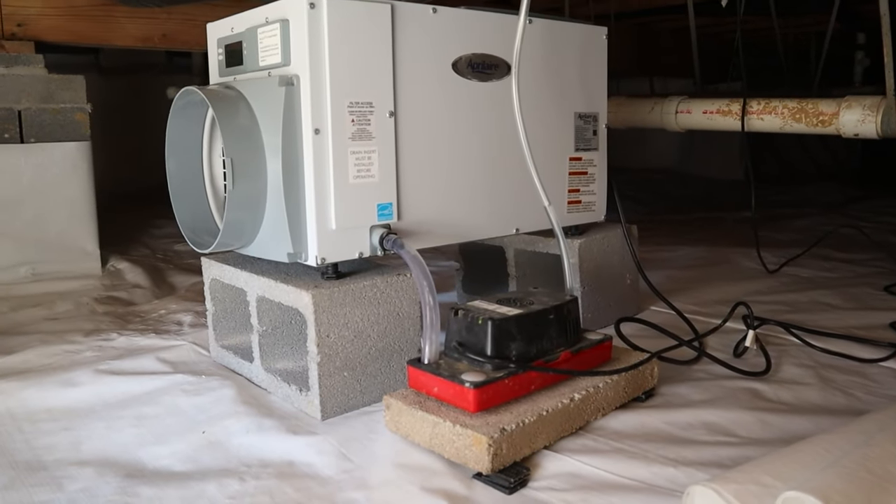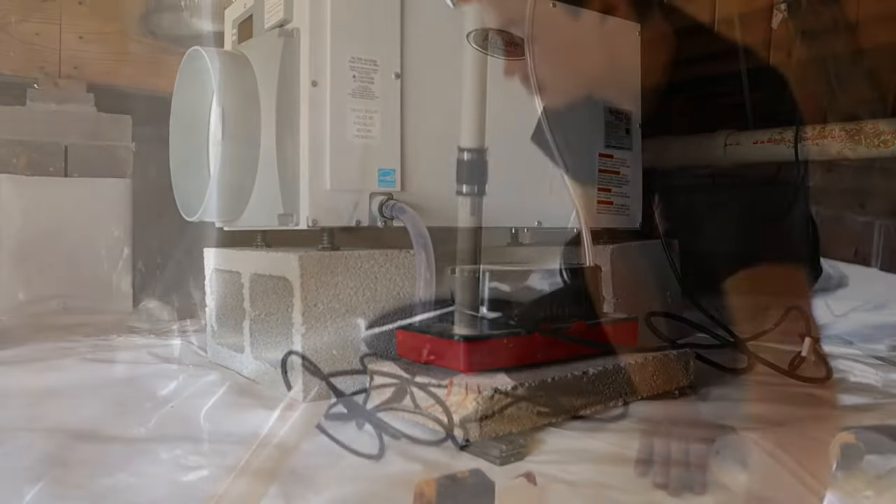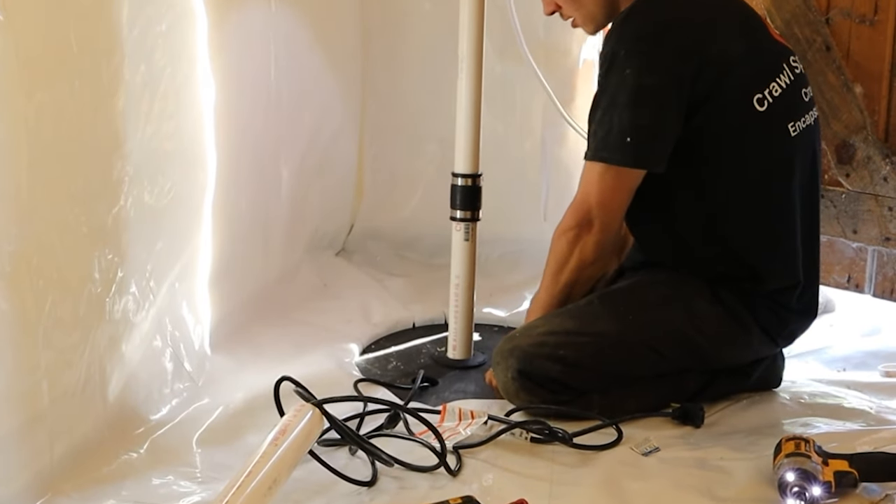You could also place them around your washer and dryer in your utility room with that water sensor behind the washer. Most home floods are from busted washer water lines — those rubber lines — I believe that's the number one reason why homes flood. So having that water sensor in there is important. Number two is probably the ice maker from the refrigerator. We've actually seen that more than anything else. And obviously for Crawl Space Ninja products, you could put the water sensors by the condensate pump — if the condensate pump fails, it will alert the homeowner — or on top of the sump pump pit, so if the sump pump shuts off and you're not paying attention to the app, that sensor will go off.